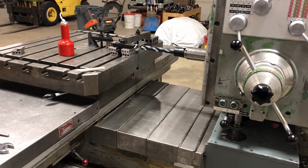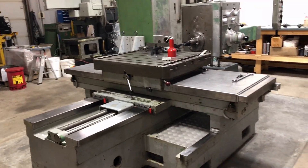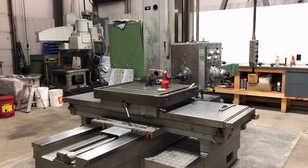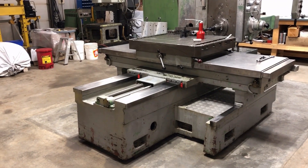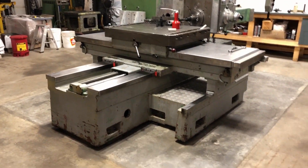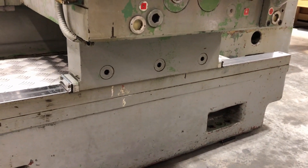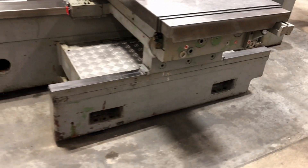It's been a pretty hard push the last three months or so - I've worked on this pretty steady. Got the table back on the saddle, then started leveling it. My first round of leveling I wasn't worrying about the column because I didn't have an accurate square to check the column's squareness to the table. So I just worried about getting the bed level - no crossways twist, no humps long ways - and aligning the outriggers parallel to the bed. Then you drop the three cam follower bearings that ride on the outriggers down to take some load.